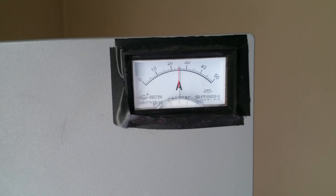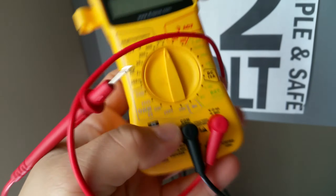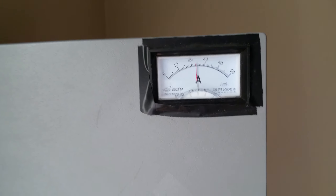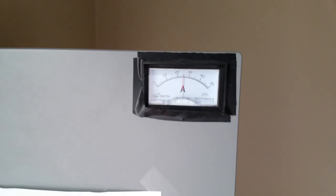My ammeter is accurate. I've used my voltmeter to test the amperage — this has a 10-amp DC capability — and with one panel I'm getting roughly 6 amps, which does show up on this ammeter. Somebody asked how I'm getting more than the advertised wattage, thinking I was running my bicycle generator at the same time. That's not the case. I'm actually getting what I'm supposed to get out of the panels and more. I've seen this peak around 33 amps; right now it's running at about 25 amps with quite a bit of overcast, so I'm not getting everything I could be.